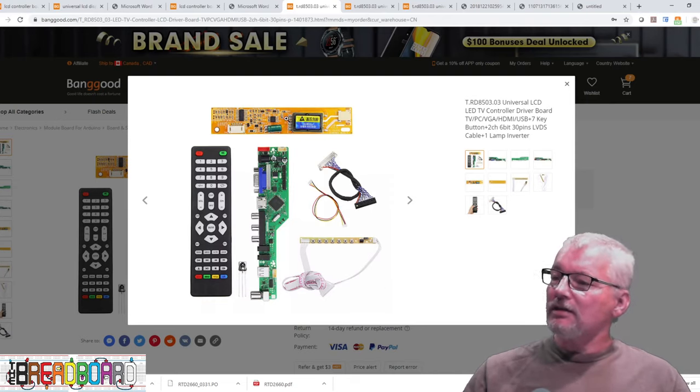In future videos I'm going to set up one of these with a box — maybe make it into a magic mirror showing schedules, calendars, or something fun. For a smaller panel I also want to try driving one of the 1366x768 panels through a network cable, maybe three to five meters, because it requires twisted pair and is differential drive. The specification allows up to about five meters for lower resolution displays. That allows having the control box somewhere else with just a really thin display sitting on a wall.